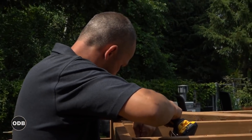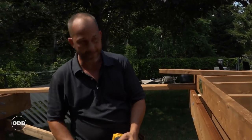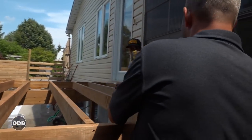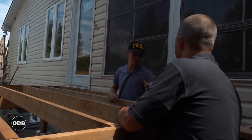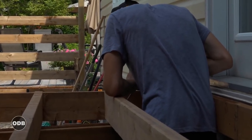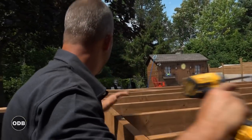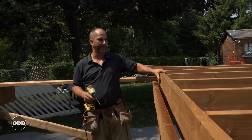Bam — in the box beam. Now Nate will take the drill and screw this joist to the box beam on an angle over there, like a toenail screw. Now this won't slide around out of position. This is guaranteed to be squared off the house and straight off the house. So now the rest of our dimensions can be measured off this rim joist.